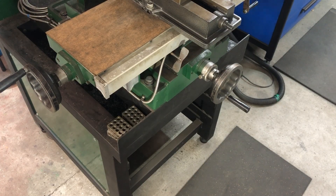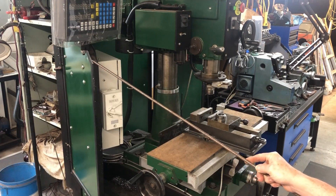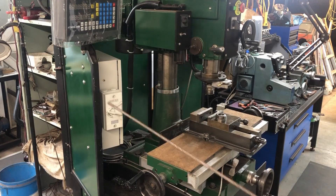The DRO display is up here on top of the door that opens, on a little hinge so I can move it around to where I want it. I've got a scale on the x-axis, one on the y-axis, and right around the back I have one on the z-axis as well. The DRO on the mill is fantastic - it's so much easier to get to dimension without having to worry about backlash. If I could recommend something to someone who's got a mill, get a DRO - they're absolutely fantastic. The same goes for the lathe as well.